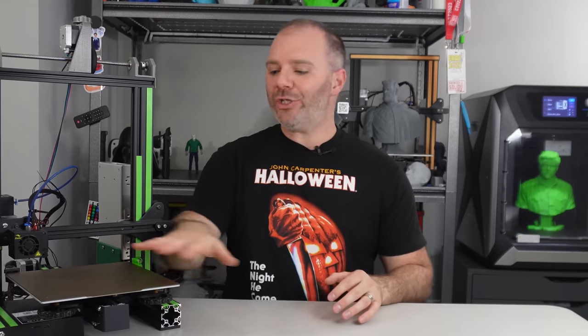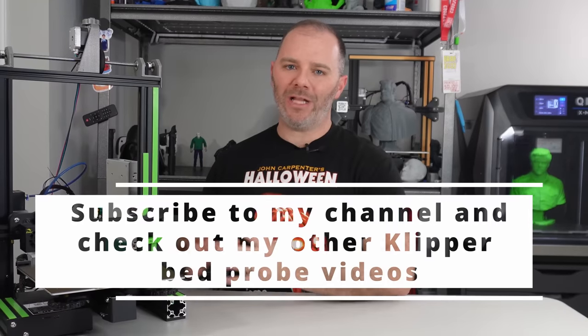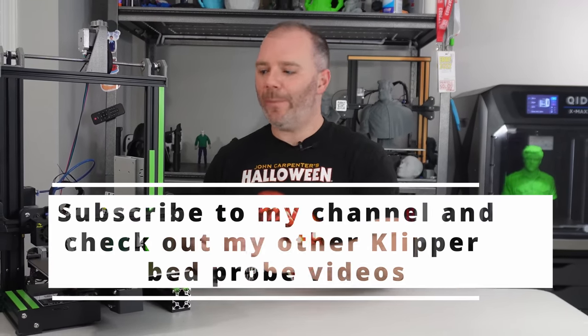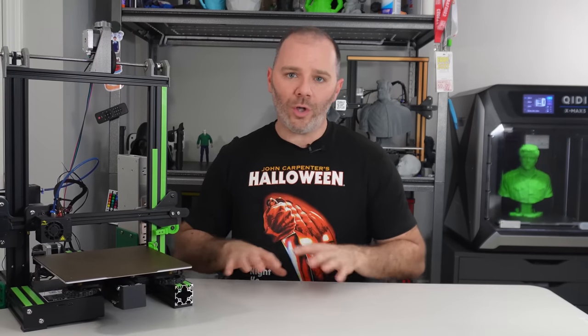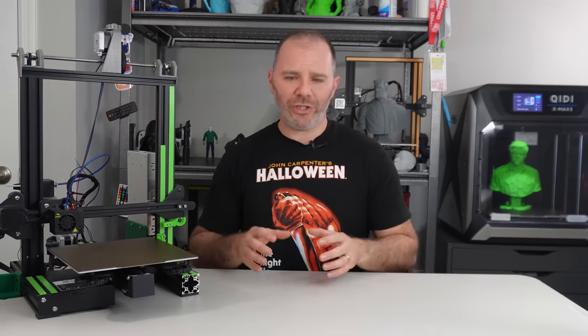Now, I note there are people on the Discord who I've spoken to in the past who have used this, and it hasn't always worked as well as it has for me. It's been a little touch and go for some people. Now, if that happens for you, I would just make sure, go through the process of screw tilt adjust again, take it step by step. Make sure you have everything set up properly. After that, make sure your bed probe is calibrated properly. And most important is the X and Y offset, because that's what Klipper is basing the coordinates of the probe on for all of its movements. So if you are having issues where screw tilt adjust isn't quite working out for you, I would look into the bed probe and make sure it's set up.